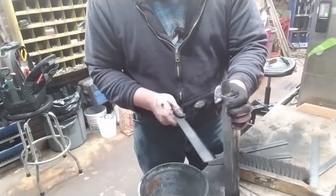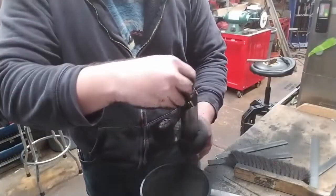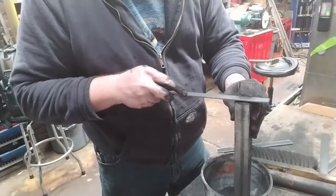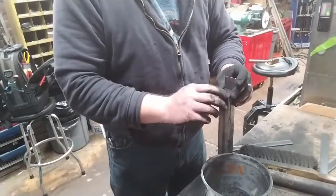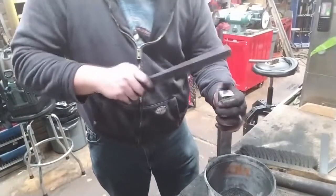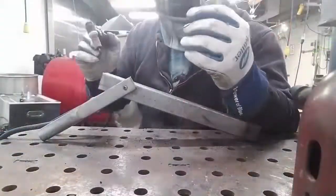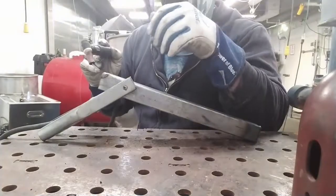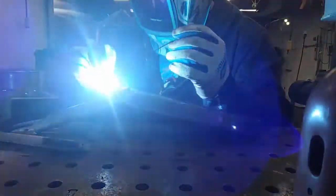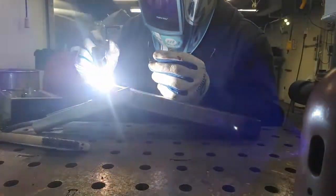And later on, you'll see when my canister really heats up, there's a tiny little torch that acts like a candle out of one end. Now, I was just using the gaps in the weld. Purposely left a few pieces unwelded that do just as well as drilling a hole. I didn't want to bother with drilling a hole with all of that carbon dust inside. But you can see it here where it spits and sparks, and you can even see a little flame erupt. And then you'll see that later when the canister heats up.